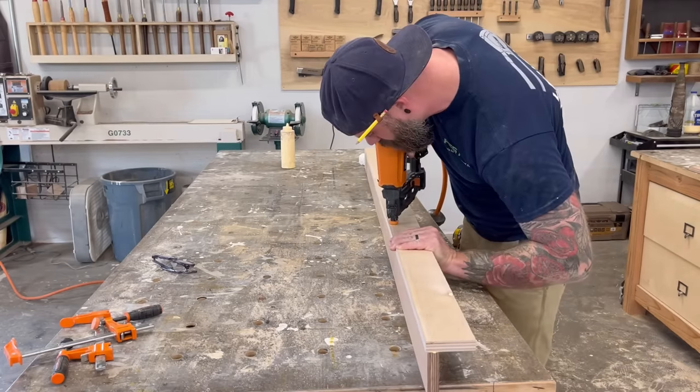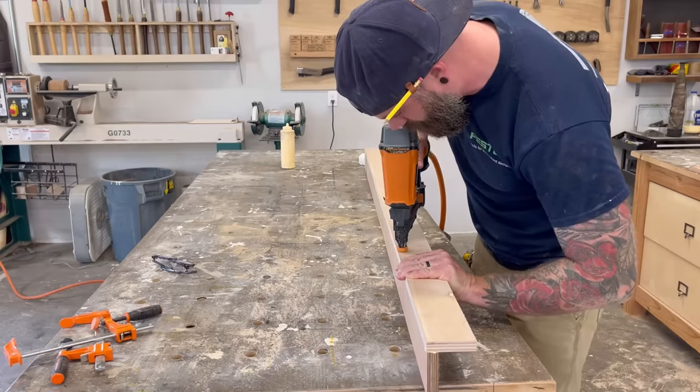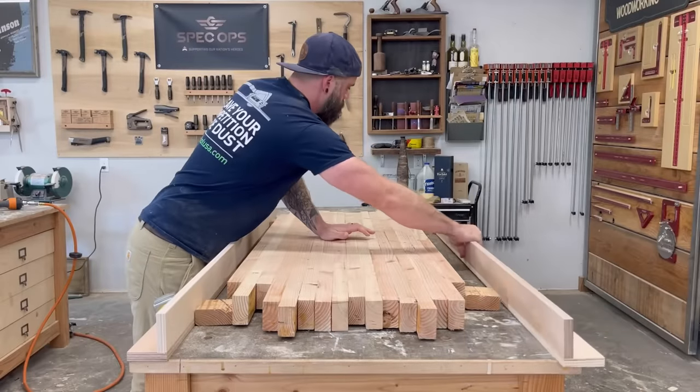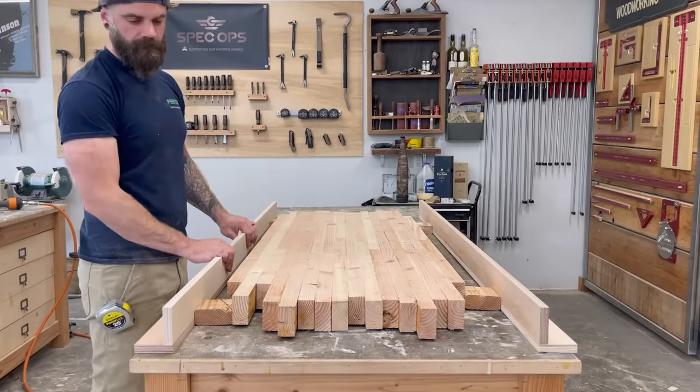After ripping down four pieces of the same height I glue them together in little 90-degree L-shaped long pieces and then tack them together with a few 16-gauge finishing nails. What you're going for is two identical pieces that you can set on either side of your slab to act as rails for your router sled to ride along. If we're working with rails, shouldn't it be called a router train instead of a router sled? I'm changing it — henceforth it shall be known as the router train.